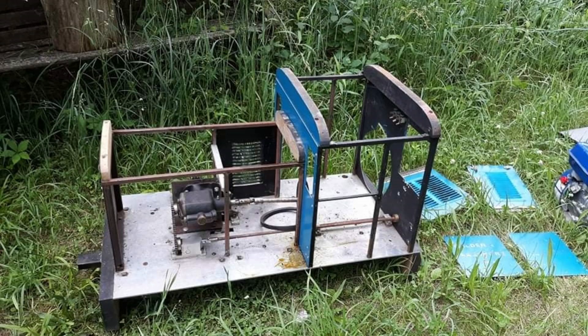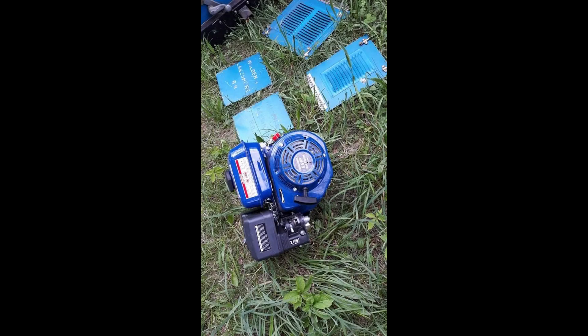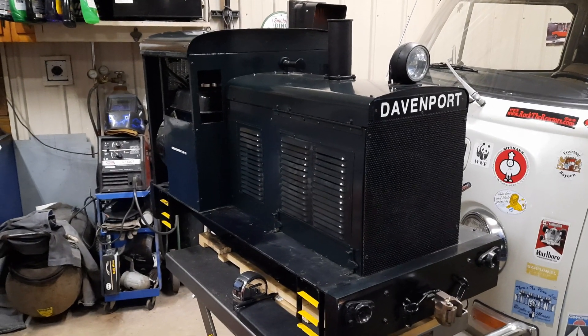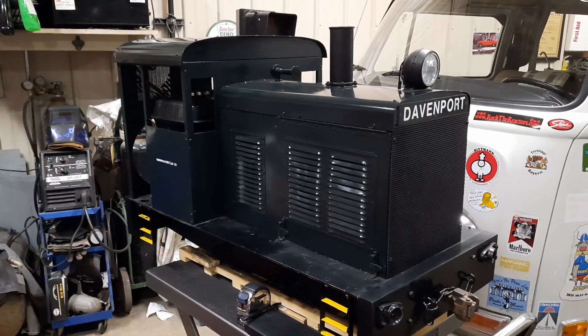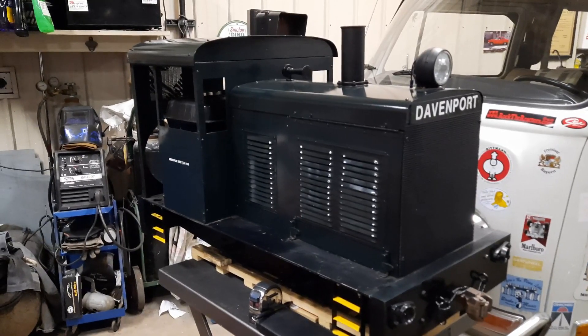When I received this engine it was a frame with a pile of sheet metal forming the body. It did not have any wheels, axles, or bearings for the axles — basically just the motor, a forward and reverse gearbox, and the shell in pieces, and I had to put it all together. I bought five-inch wheels off of Role Models Inc out of California. They were a little bit too wide to fit in the frame, so I had to use a lathe to thin them up a little bit, still within IBLS — International Brotherhood of Live Steamers — standards.